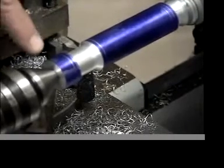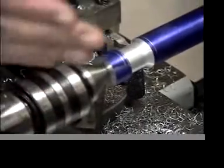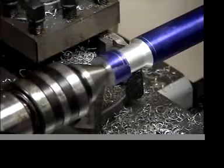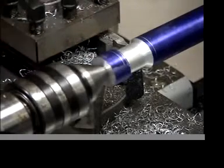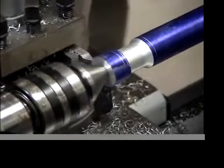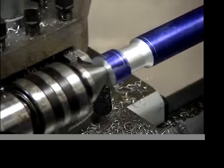Okay? I have to do one more 45-degree over here. I'm going to do the same thing, and I'm going to keep on taking material off until I form that corner. Actually, in this one, I can go in that direction. It might be a little bit easier. So bring it over there. This part you're doing kind of by hand. Don't take all the material at once.